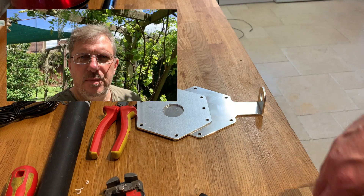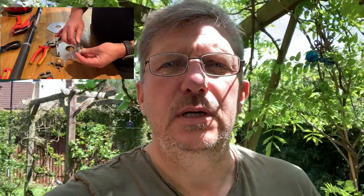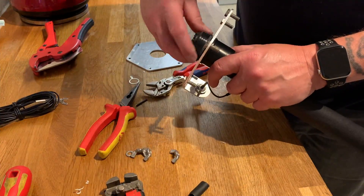Hello, my name's Mike, Zero MSN, and you join me on a glorious day here in the Gloucester countryside. I have recently acquired a DX Commander Rapid and I'm not going to show you a video of how to put it together — I'm sure there'll be plenty of those. But what I will show you is what I've done with my particular version. I would like it to do the 40 metre band, 20 metre band, 10 metre band, perhaps even the 6 metre band, 2 metre band. So this is how I've managed to get those particular bands working on my DX Commander Rapid.